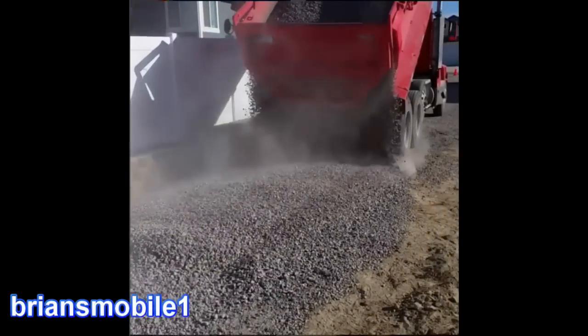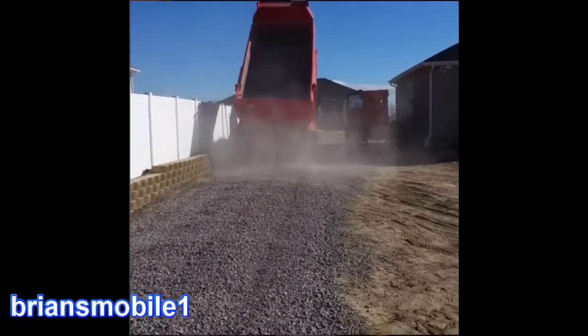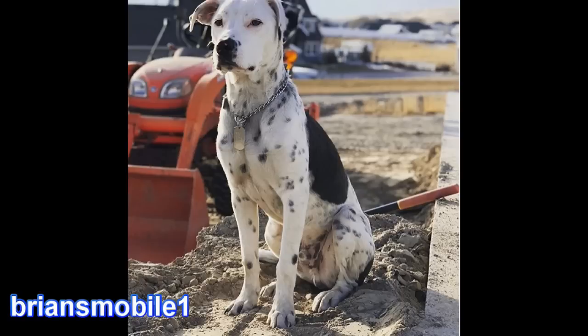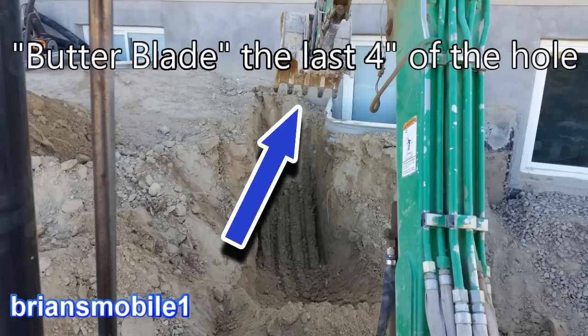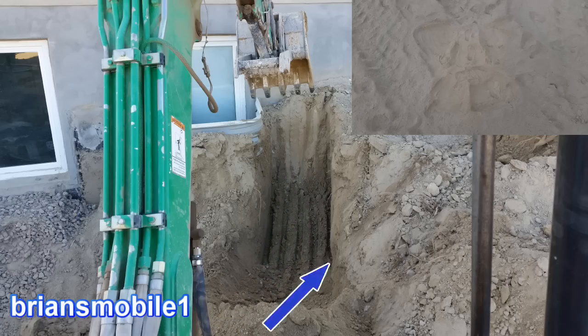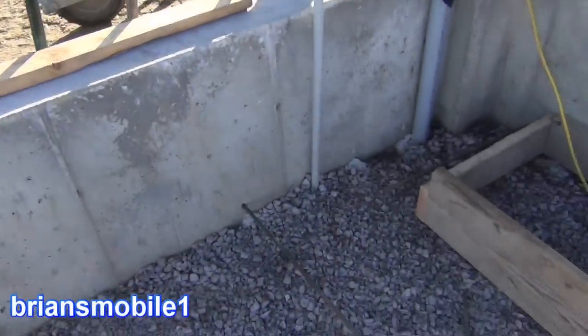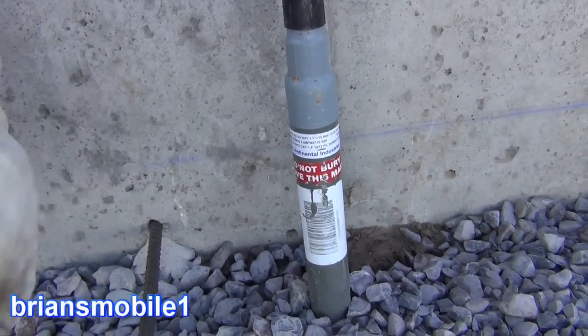When you've got your gravel laid down, I hope you have a good driver — thanks Craig. You change it so it doesn't open all the way, it makes it work like a dispenser. Once you've done that, compact it again. Most of my floor, and according to city code, you have to have your stuff sit and let the weather make it rock hard. When you excavate, make sure you use a butter blade — no teeth on the excavator, no teeth on the skid steer. It's got to be a smooth blade so everything's cut and compact, because otherwise if it's loosened it will settle.